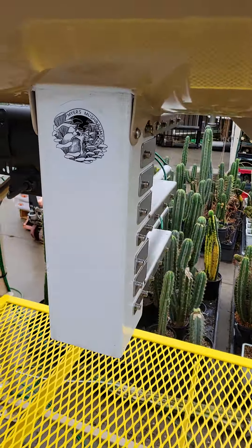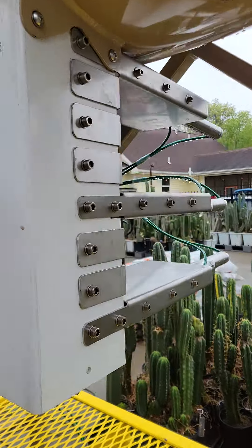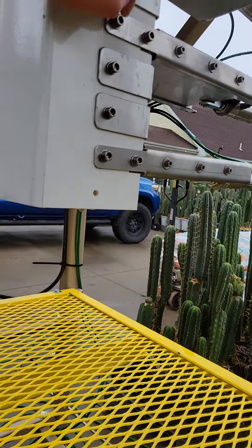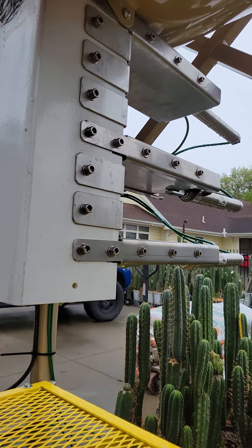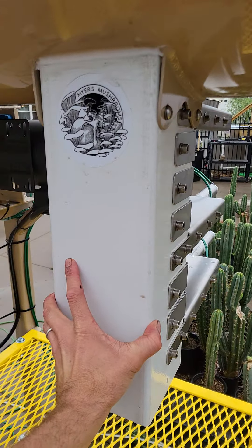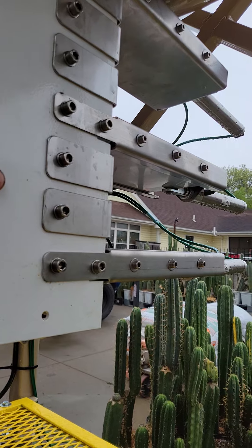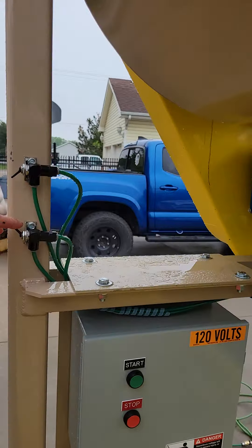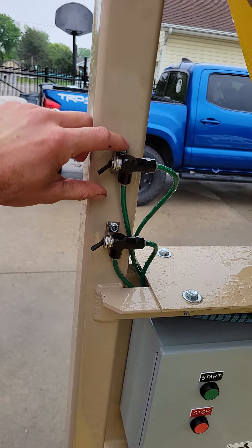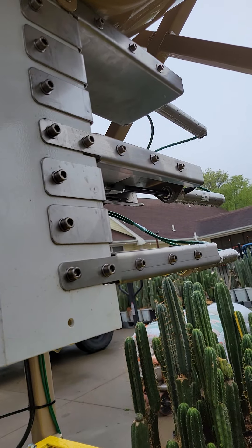The biggest improvement is the bagging attachment. This bagging attachment can easily switch between using the bottom valve. If you want to do a 7-pound fill, this is the smaller 6x6 for 14A's and 3T's. And if you want to go ahead and bag out some 4-pound bags, you flip this switch — it disables the top one and enables the middle one, and now you're doing 4-pound bags.